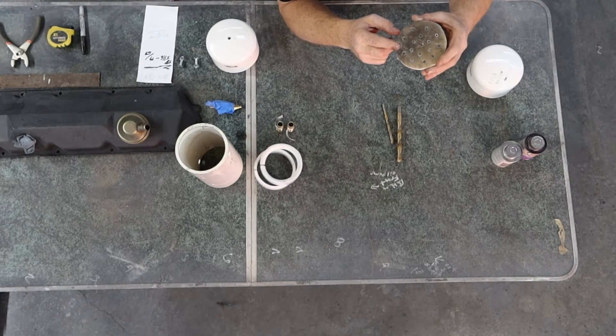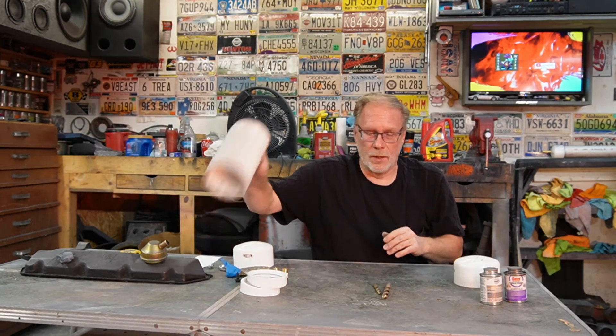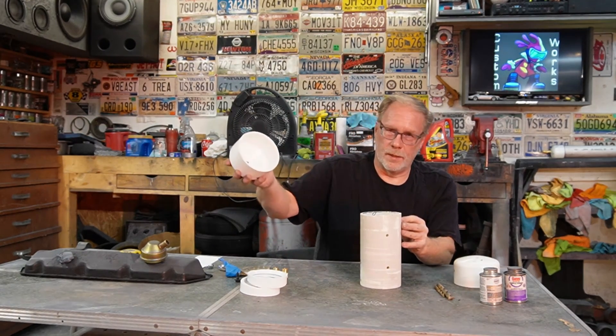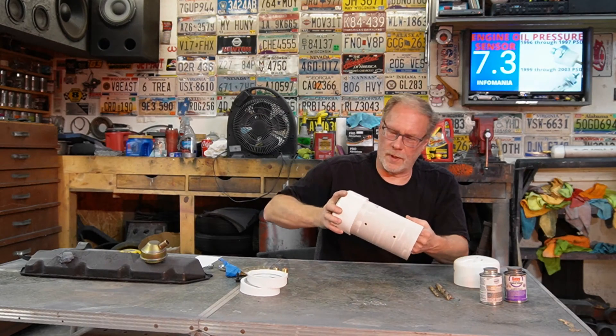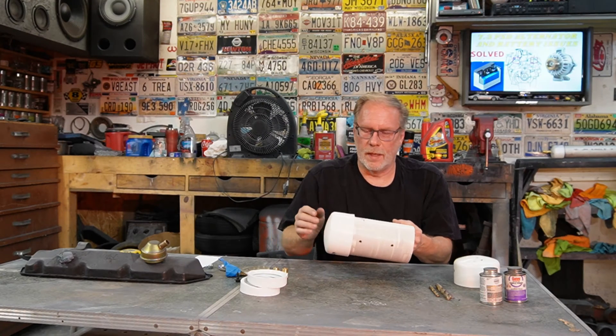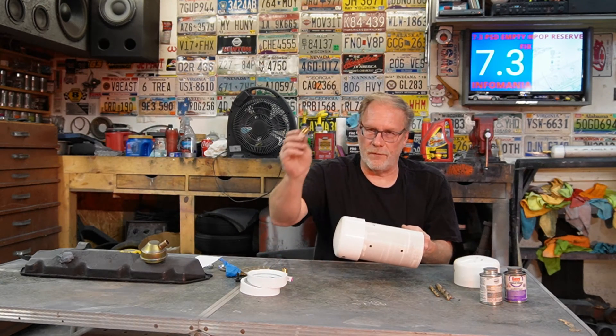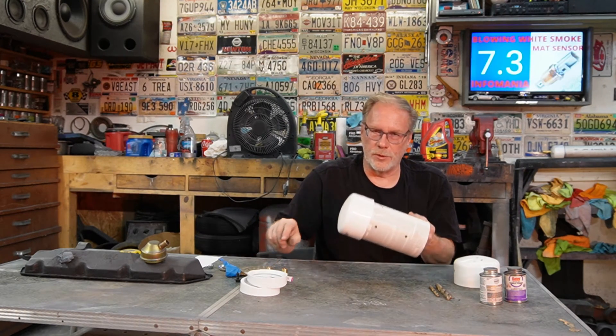This insert is going to be sitting at the bottom of that 5-degree wedge inside the pipe, so it's going to drip down like that. With your 4-inch, 8-inch pipe, go through and put your cap cover on all the way. Drill your hole — this hole is for the 5/8 threaded end, and that drill bit has to be specifically 37/64.